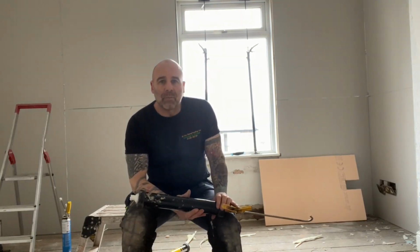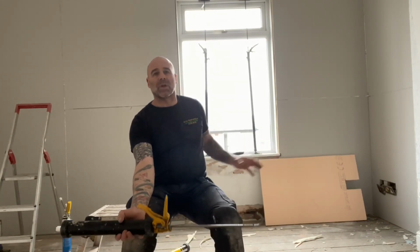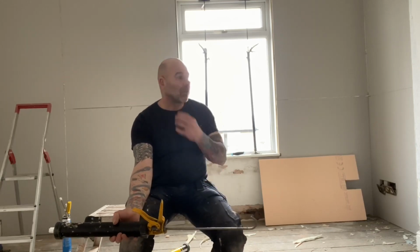these are external walls. On the outside, well, it's a traditional built, I'd like to say it's a terrace. It's an end terrace, traditional built end terrace. So before 1919, as Historic England like to have that figure as a starting point for traditional buildings. We all know that some have been built after. But so there's solid built walls built from headers and stretcher bricks.